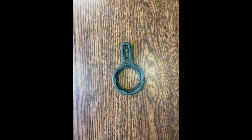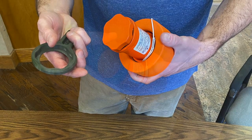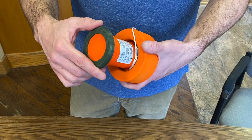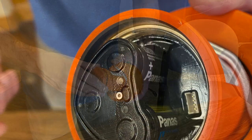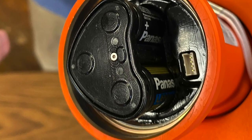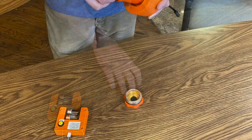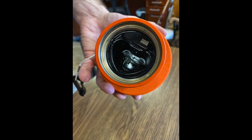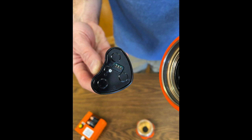Battery replacement is only slightly more difficult than replacing a flashlight battery. The bottom cap unscrews from the beacon; in most instances it can be removed by hand, but if necessary a wrench or an included tool can be used. Once the cap has been removed, the battery compartment slides out of the beacon. The six CR123 batteries are replaced in the battery holder — those batteries are readily available on the commercial market. Care should be taken when reinserting the battery holder into the beacon. Note the connector.